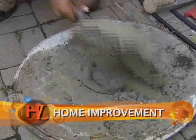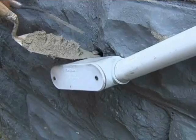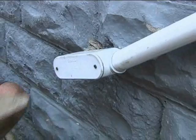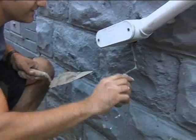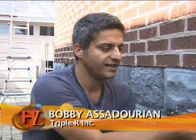Get it nice and flowing. We use the big trowel to mix it up, then we're going to use the smaller trowel to apply it. This fantastic tool is called a slick. You want to get a nice amount on your trowel, get in here, and slide the product in. Make absolutely certain that you penetrate — about three-quarters of an inch to an inch in there. Work your way all around. It's all about layering; get a few layers in, push it, compress it. This will have to harden at least 24 to 48 hours — leave it a few days. This will not be loose any longer. It's going to be nice and sturdy. We've achieved structure, and then we're going to caulk the perimeter.